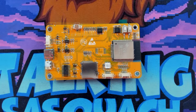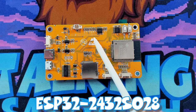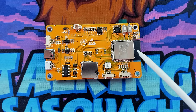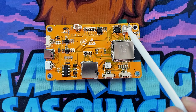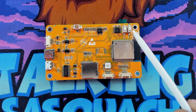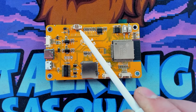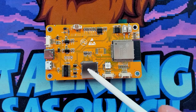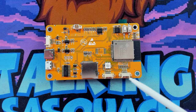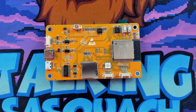If we flip this over, we'll see there's a lot going on here too. The Cheap Yellow Display's actual name is the ESP32-2432-S028 — not really the catchiest of names. Right here we see the real brains of the operation: the ESP32 module, which does Wi-Fi and Bluetooth. Then we have the boot and reset buttons. We don't really need buttons for the screen because it's a touchscreen. We have a JST connection for a speaker, micro USB, USB-C, a power supply connector, and plugs for extended I/O and a temperature and humidity sensor.